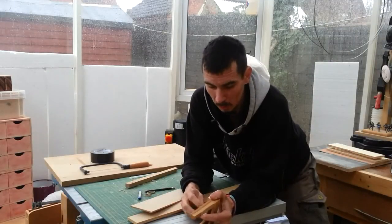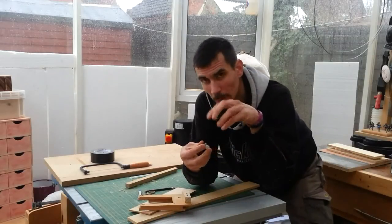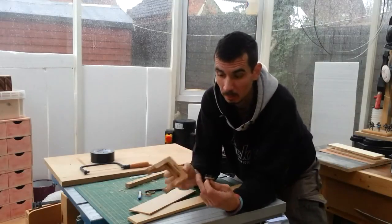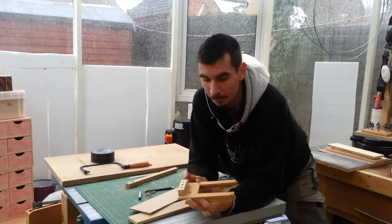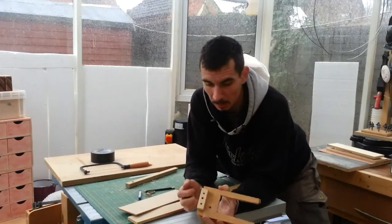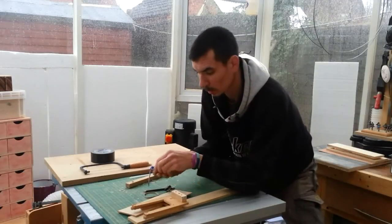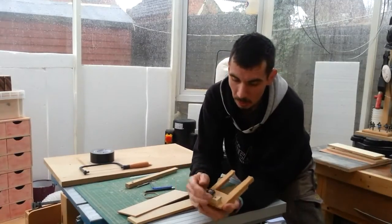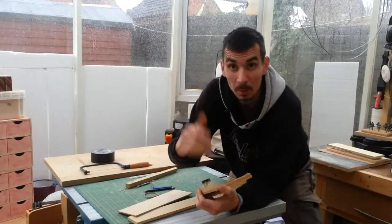On the original model, I've got this, I think it's a quarter 20 to quarter 20, just a little riser, so it fits in between the camera tripod lug and a digital camera. I screwed this in because I didn't have any screw thread in wood, like you get on the bottom of a proper camera. I just drilled a hole and screwed it straight into the MDF, and then used hot melt glue to hold it, but after a while that came undone. So what I did was I got this piece of, I think, sycamore, and drilled some holes in it, and tapped it, and then I can screw this into there, and that fits on the top of a tripod. But obviously it works with gaffer tape and a bit of MDF.